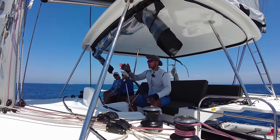Now as we have released the line in the back, the boat also went a little bit forward, and the chain is now going like this. The wind is coming from here, and this is actually kind of good, because you see it's less force on the anchor. If you tension the anchor straight and the back line straight, you're going to have a lot of force. So you want to have both pointing a little bit upwind, the line in the back and the anchor, and then the bigger the angle, the less stress there's going to be on the anchor itself, so it's not going to drag.